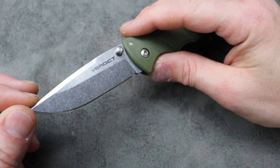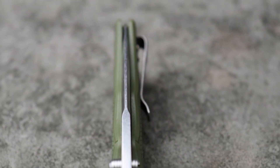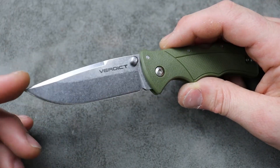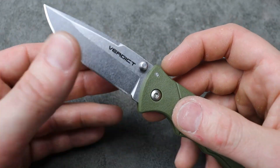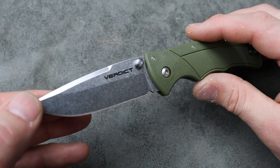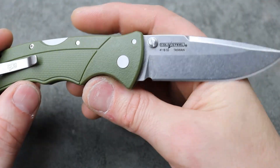It's a robust blade — about 26 thousandths behind the edge. It's a work knife, something that's going to work well for regular everyday carry but also as a tougher tool for those who don't want to worry about breaking their tips or microchipping. This is going to have a very tough edge; if you wanted to make it a little slicier you could lower your edge angle and increase cutting performance without sacrificing too much toughness. Nice stonewashed finish that'll help hide the scratches.